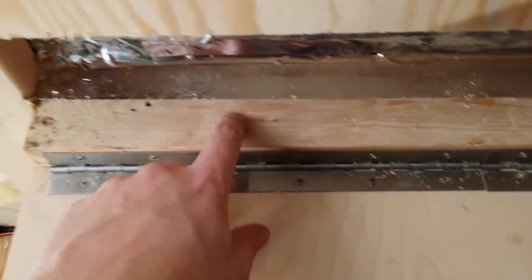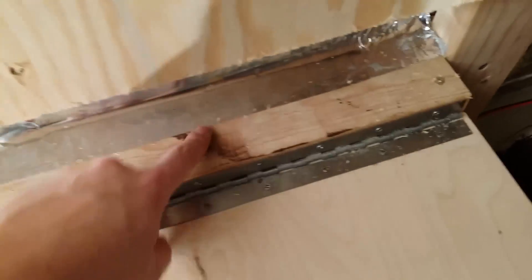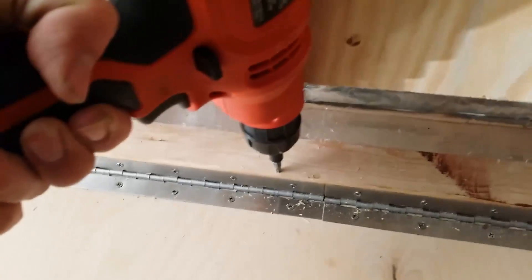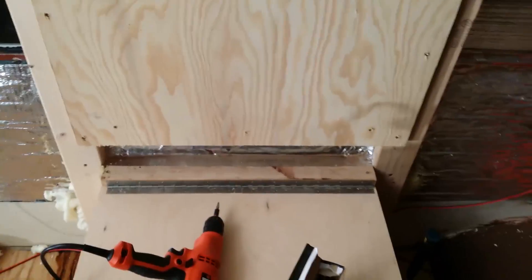I just realized that in an earlier step I said I was going to drill through this board — there's a two by four and nothing underneath it, and that's where the wires are going to run. I made my life a lot more difficult. You can see with the drill it can only go straight up and down where it hits. But it's not a very big deal — there are only two wires, or three if you count the grounding wire, that need to go through there.